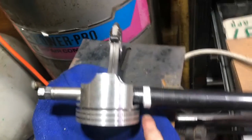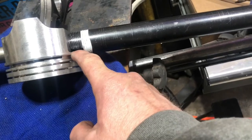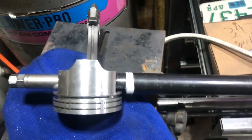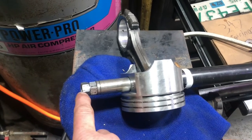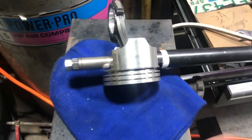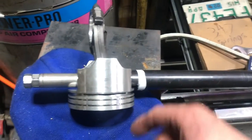Basically I just took a piece of 12-inch black pipe and notched it out so it misses the piston skirt or the piston rim. Then a piece of threaded rod, and I got a socket that just fits — just a little bit smaller diameter than the pin so it fits through. I double-nutted the rod, hold my wrench on here with my impact.